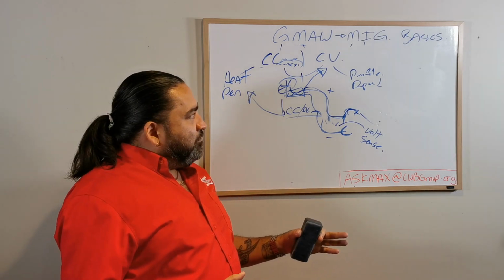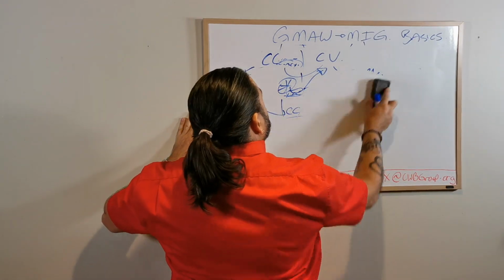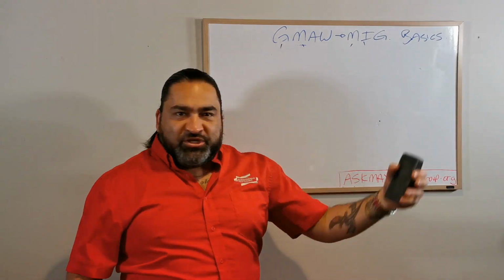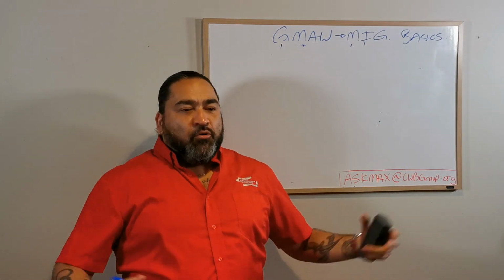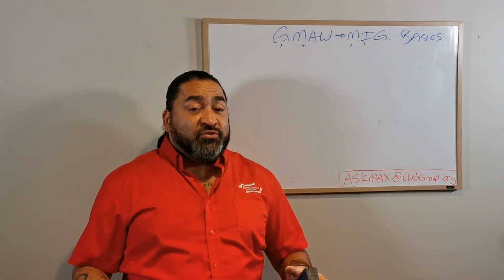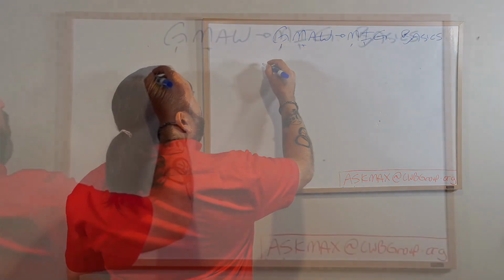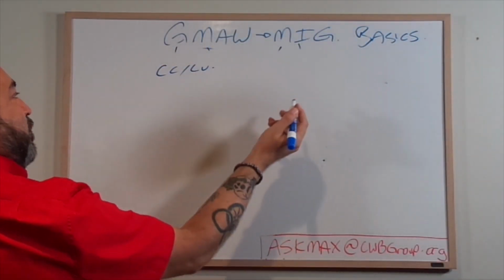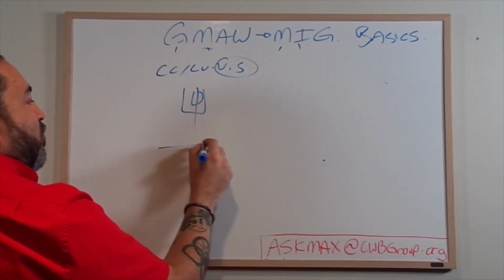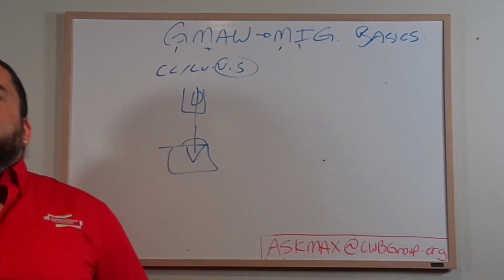Now, the last thing we're going to do, because I'm coming up to my limit of how long I need to keep these lessons. Remember, CC, heat, CV, arc length, or a mix of the two. Now, we're talking $30,000 machines when we're talking about mixing the two. This is now cutting-edge, cool stuff. What you get now is a wire, if we go CC, CV, volt sense, right? What we now have is a wire that can also penetrate and control width and profile.